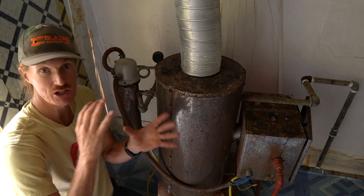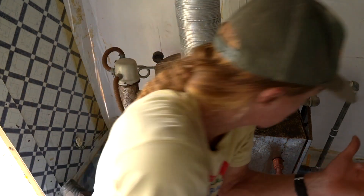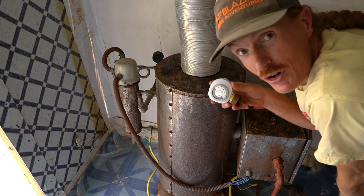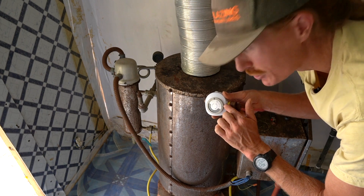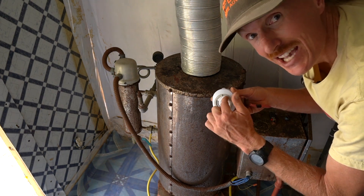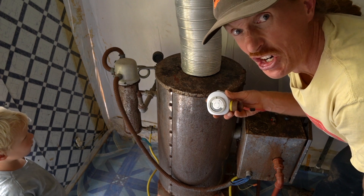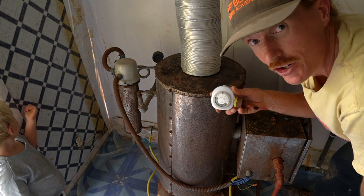I come down and check it, set my watch, make sure things haven't run out of gas and nothing weird is going on. As a backup to this system, I use this simple light timer. It takes about 45 minutes to build up to 15 PSI, so I account for that — this is a half-hour increment timer and I have it set to go all the way around to five and a half hours. So if I get injured or my alarm doesn't go off, this will automatically turn off, which is a nice little safety to have. The pressure just hit its point and clicked off — now it's going to drop back down, which takes about 10 minutes.